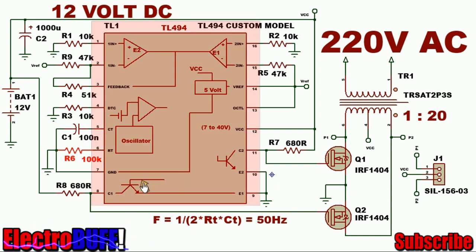When the first transistor conducts, it will basically shunt the gate of this MOSFET to ground, so this MOSFET will remain off. But the second transistor will be off, so there will be a VCC voltage at that point and the gate of the MOSFET will be pulled up. The MOSFET will conduct, allowing current to flow from the VCC rail through the left half of the primary winding through the MOSFET to ground.